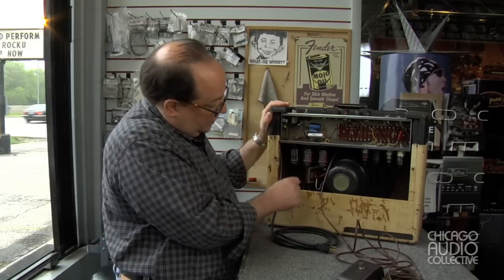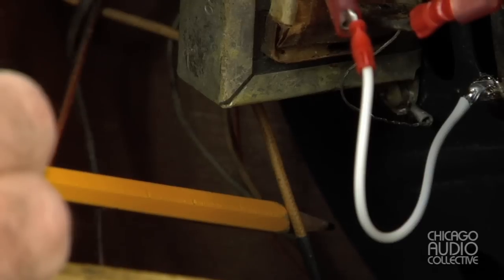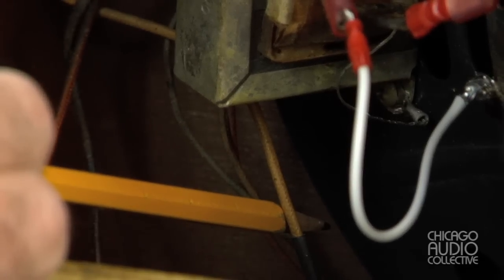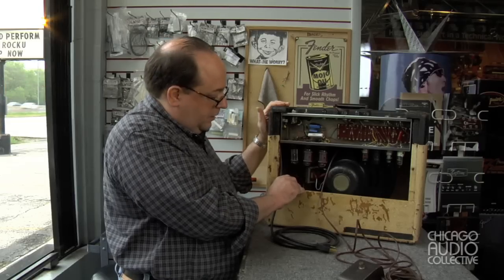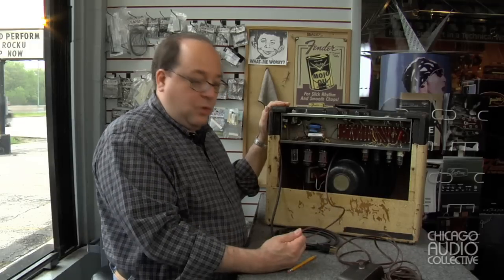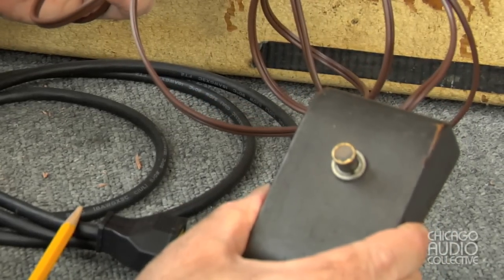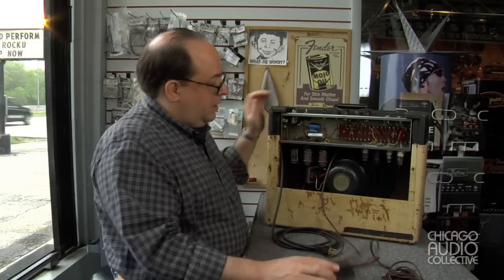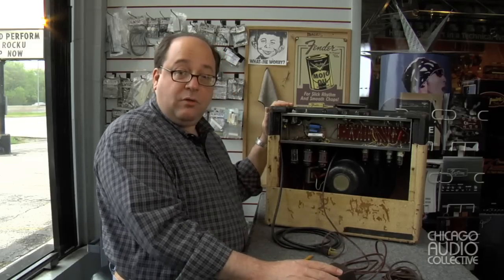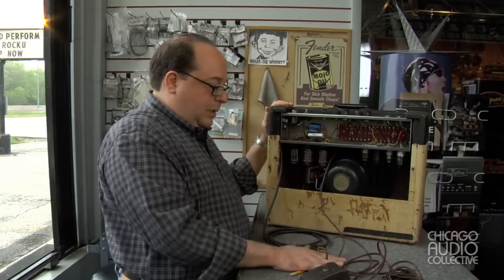They were re-drilled and the wires were spliced. But this time they're spliced correctly, and we used heat shrinkable tubing, so there's no chance of shock or short circuit. In addition to that, we have a new tremolo cord on our nice tremolo switch. The original switch was able to be retained — I just cleaned it, reinstalled it, and wired it up, and it sounds great and works great, and we're all set for lots of years of use.